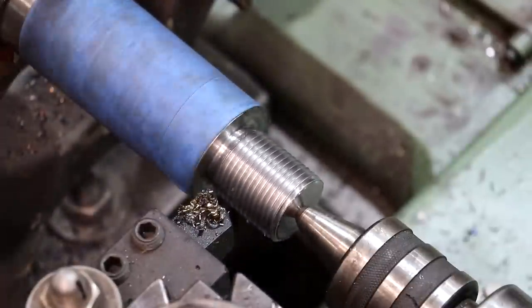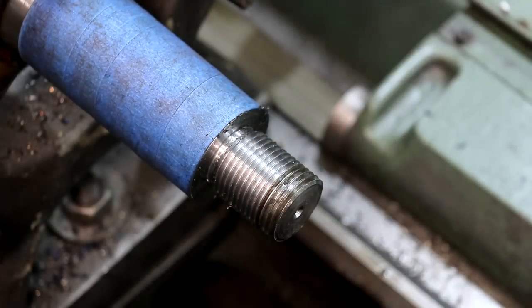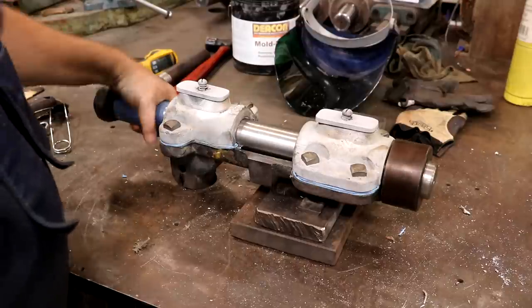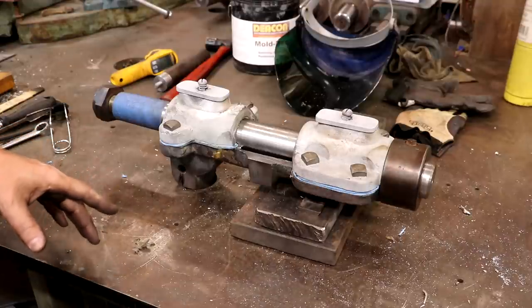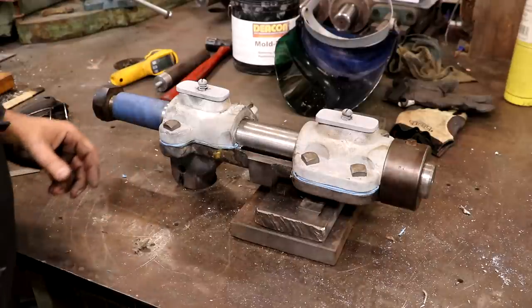I'm going to do a test fit here. It's starting up on there, and actually it's a little bit on the tight side but it fits. I may just take a scratch pass and see if we can loosen it up just a little bit. With that, our shaft is ready to go back on the machine. I haven't put any oil or anything in here yet - of course I've got to get the hub put on and a couple other things that need to be done to the wheel itself before we are ready to mount everything back up on the machine. But this part is ready, we can go ahead and get the bearing housing mounted and continue on with this restoration project.